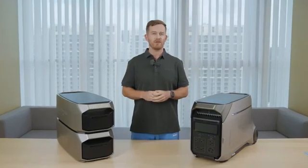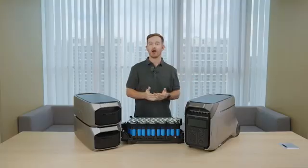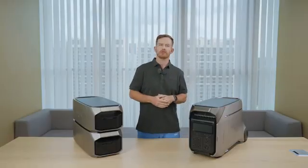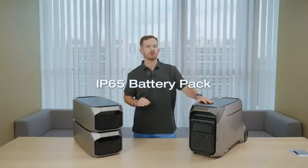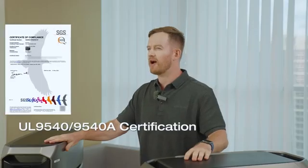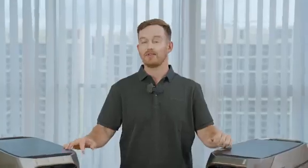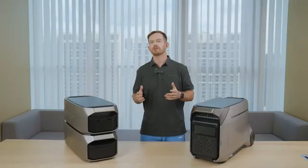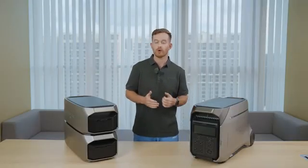Speaking of safety, we've taken extra steps to ensure the Generator Pro provides peace of mind. The Delta Pro 3 is equipped with EV-grade LFP batteries housed in a cell-to-chassis battery pack — these batteries generate less heat and offer up to 4,000 cycles before dropping to 80% of original capacity. It's also the first in the industry to achieve IP65 water and dustproof certification, meaning the battery pack can withstand spray, dust, and moisture. The battery pack has also passed the stringent UL9540 and UL9540A standards. These layers of protection significantly expand Delta Pro 3's utility — use it confidently at home or bring it to beach parties, boating trips, or music festivals.